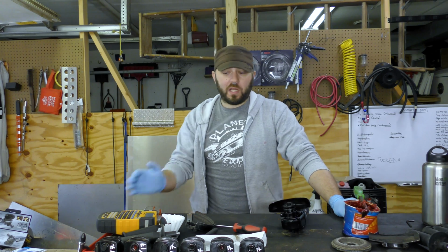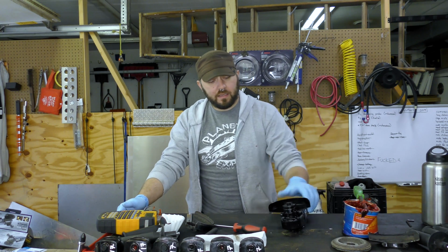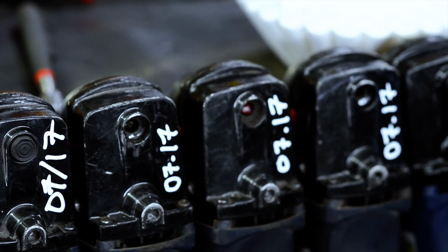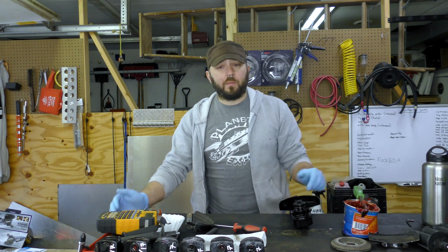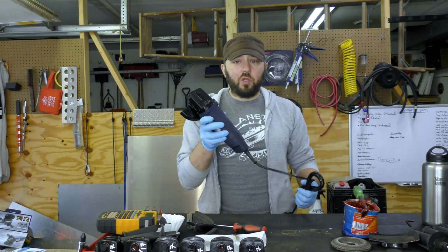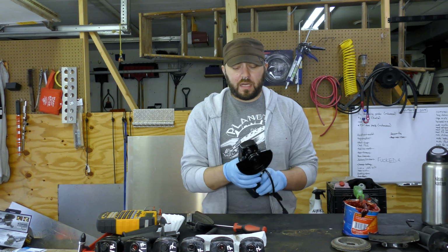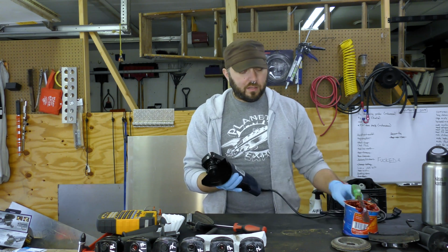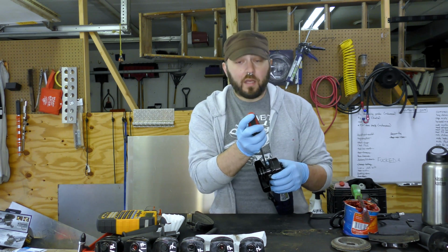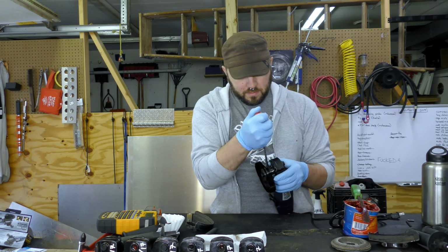After every event, while I'm unpacking, I'm also kind of cleaning and maintaining tools, and today I'm going through my array of paddle angle grinders and rebuilding all of them. Some of them had stopped working, some of them had brush issues, and I had a couple of new ones that haven't been serviced at all. These are generally okay right out of the box, but I don't love the grease that they use on these. So first thing I do is rebuild them. And I'll walk you through the steps that I use now.